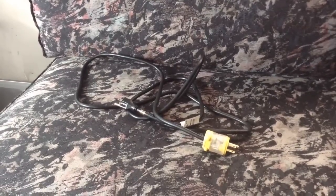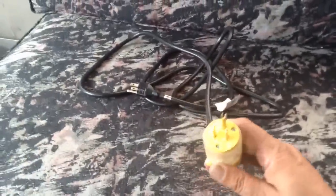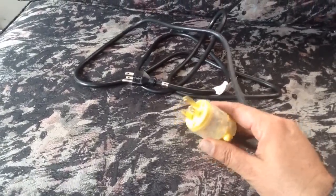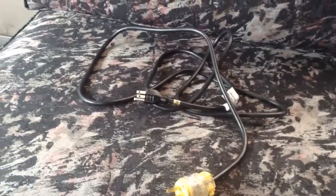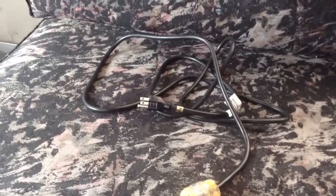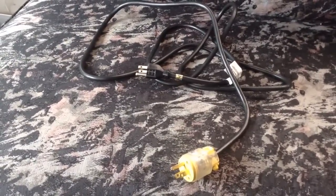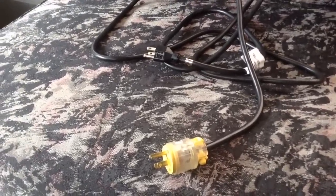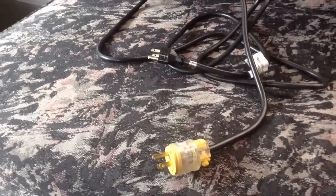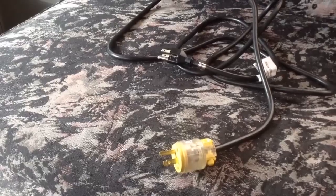This is what's called in the electrical industry a suicide cable. It's a power cable where the polarity has been very carefully checked and double-checked — we'll show that in a later segment — with male on both sides. This is used to link two normally not connected power systems in AC. For example, pulling a motorhome or travel trailer up to a building where the umbilical cord isn't going to be hooked up, or it's broken, or it's not long enough, and you simply want to link to the nearest power outlet to get one leg of each circuit going.